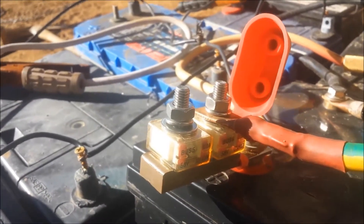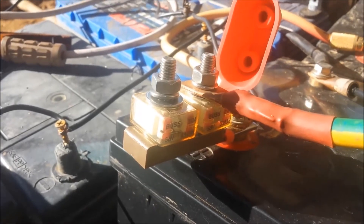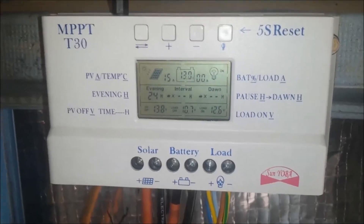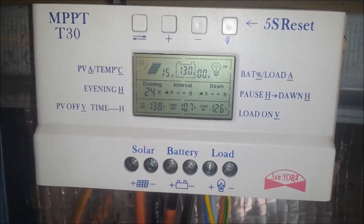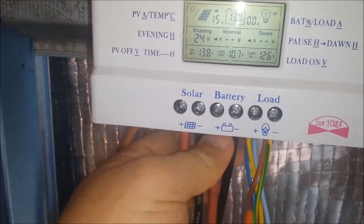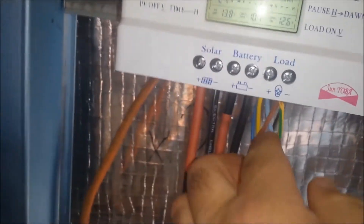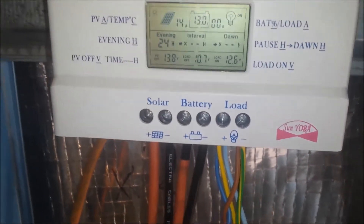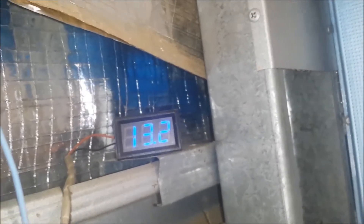Finally I've got a Blue Sea fuse block there. We've got a 250 amp fuse on there just to protect things if there's a problem with the inverter. There's the 30 amp MPPT charge controller — positive and negative leads coming in from the solar panel, and positive and negative leads going out to the battery. On the load side we've got two sets of LED lights running as well as an LED voltmeter. Then we've got the 1500 watt modified sine wave inverter, with the positive and negative leads coming in from the battery at the back. Again, handmade lugs screwed on to the post.